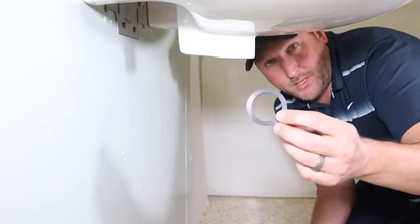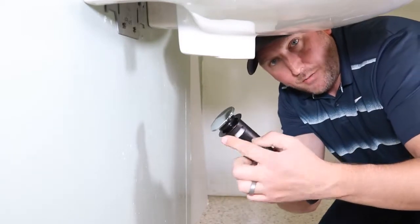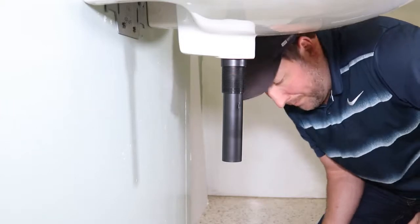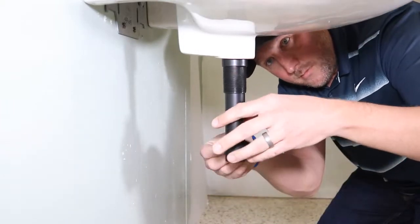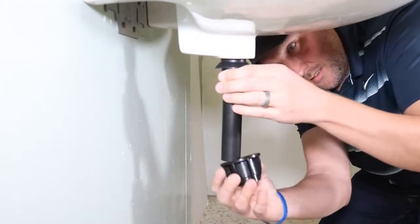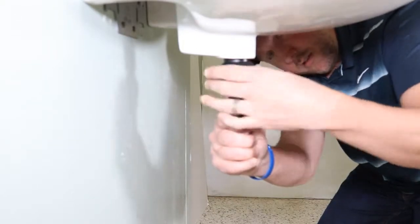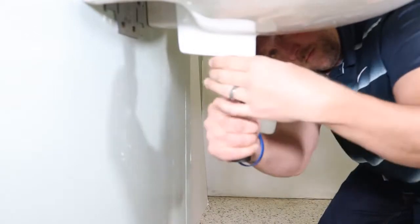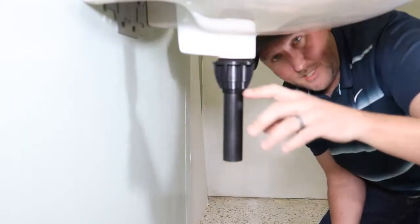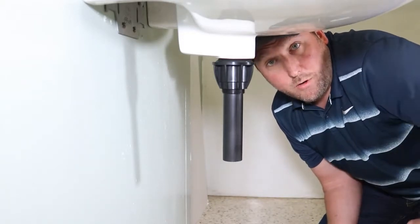In order to put this in, it comes with a gasket — a small gasket that goes under the bottom. Some people like it, but I typically use plumber's putty and apply it around this flange. I would drop this down through the top of the sink. Then you would take your larger beveled gasket, slide it up from the bottom, and then take the nut, slide it over, get it started, and tighten it up. You want to get it good and snug — you don't want to over-tighten it in case it may crack the sink. On the top side, around the rim, just wipe out any plumber's putty that may have squeezed out. Then put some water in it and test it.